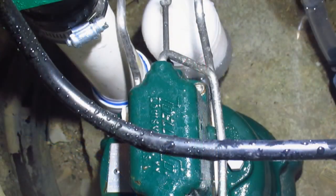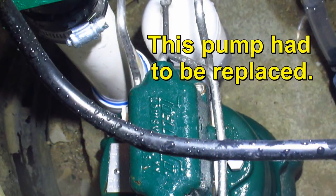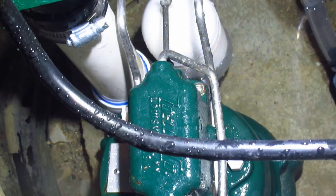I just had my main pump float switch fail, but luckily the pump remained on all the time. If it had not been running, it would have filled the well and overflowed. Since the green pump failed, I added a second pump — the black one. Its float level is slightly higher, so if the primary fails, the black secondary one will take over. But again, these both require power from the wall.